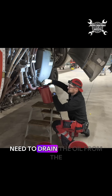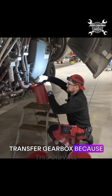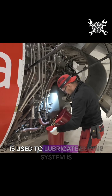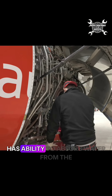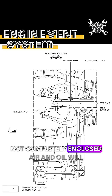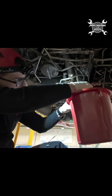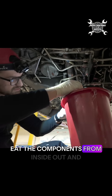As the next step, we need to drain the oil from the oil tank, from the accessory gearbox, and from the transfer gearbox, because this oil was mixed with the preservation fluid. The reason is that the oil used to lubricate the engine system is slightly hygroscopic — meaning it can absorb water from the air. Since the oil system is not completely enclosed, if the air is humid, the oil will extract water from it, become slightly acidic, and slowly eat the components from the inside out.